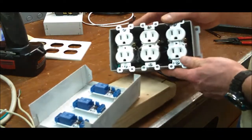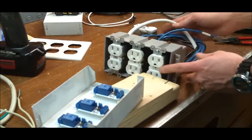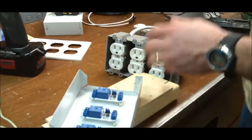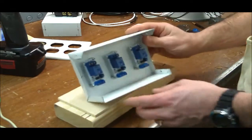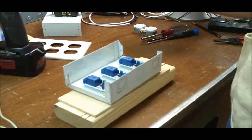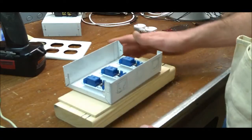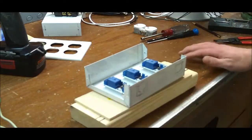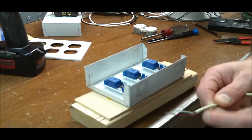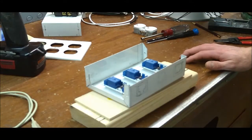My plan is to put all electronic components in another location so I can electrically isolate them from the mains electricity. Once I plug this in, my Arduino will be in its own little box completely away from all the mains electricity, and hopefully that will eliminate the interference. I might go look through my junk drawer and see if I can find another shielded wire — maybe an old serial cable. I can just chop off the end and use that. It'll have more wires than I need, but it'll give me a nice shielded cable.